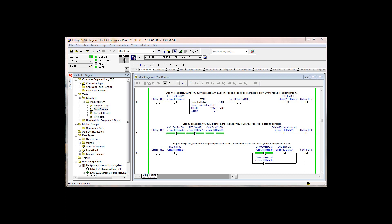This is real typical for commissioning a project on the shop floor. You write logic that gets it close — close enough that you know you're not going to damage any equipment or wreck expensive product — and then you start running it. When you run into things like we did, where we had to go back and prevent a rung from re-executing the latch, you make those edits. We're going to continue on and won't follow the manual step by step at this point.